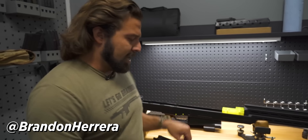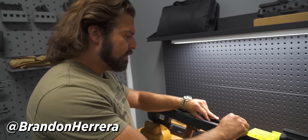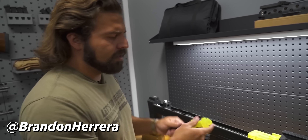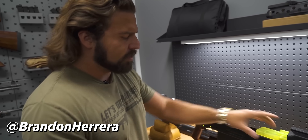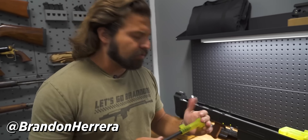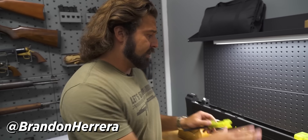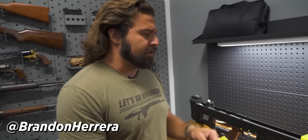We've actually incorporated helical lockup, which the original AK did as well. We're hoping all of that is going to help us with feeding, function — just the entire guts of the gun, which is really just the bolt carrier, the bolt, and the front trunnion. That's where your lockup occurs, and that is where you're going to have the most problems typically. I really hope this is what irons out pretty much everything.